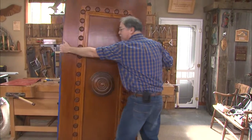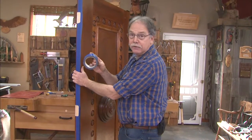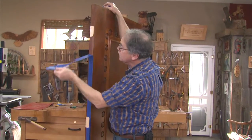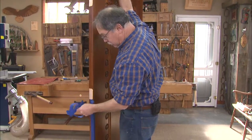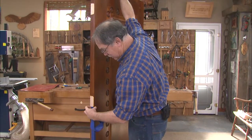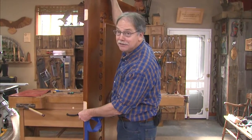And remember, when you're replacing a door, all you need is blue painter's tape — take it to the hinge pattern that's already on the door, start from the top, and cut out the mortises by hand. Do not make them deeper than the thickness of the hinge and you're in business. Time to make custom doors in your home — you'll be glad you did.